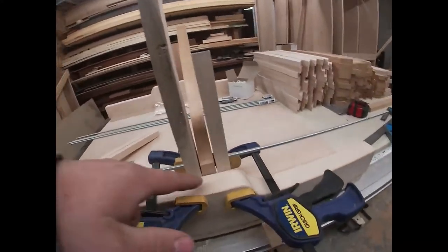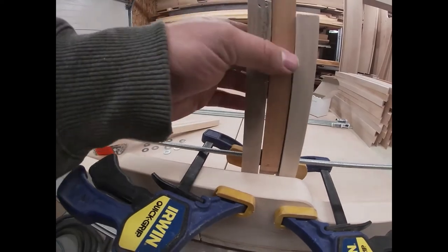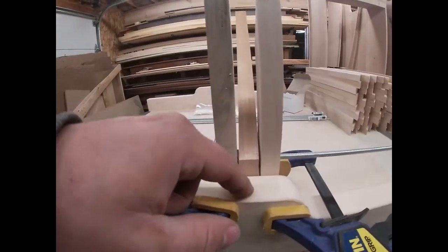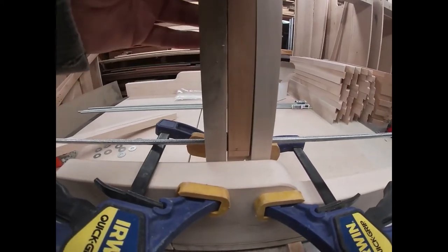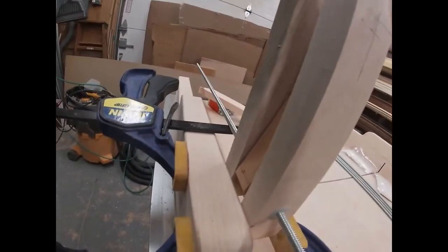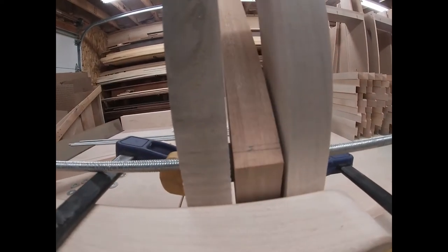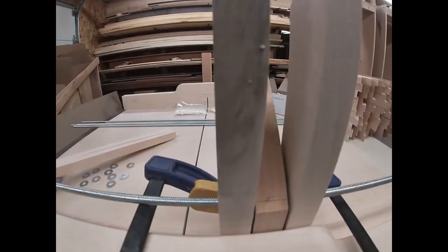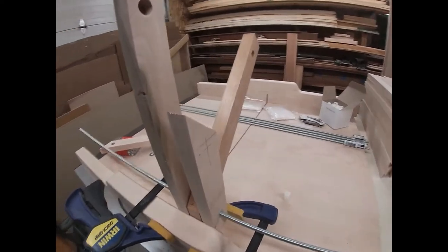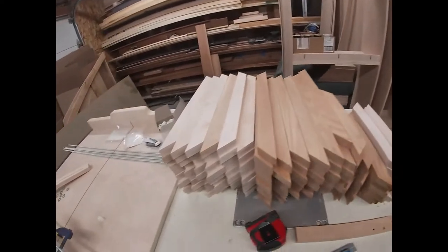Now on the back side, when I assemble the whole thing, I have to put some cleats because I don't want it pushing against the drywall. The cleat is going to start probably right around where this is, so it doesn't interfere with the action of it moving, because if you look at it, that little nub does come out just a little. But we still want the cleat there to stop it. All right, so now that I have this set up, I'm going to put a fence and a stop on there and drill a whole bunch of holes.